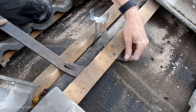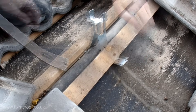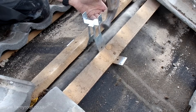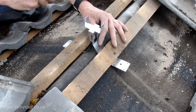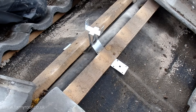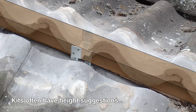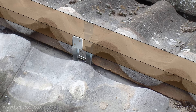Once you have it under the tile battens you can bend the brackets a little more ready for sliding onto the truss beneath. Use the flat pry bar if you need to. Once you get the legs onto the edges of the timber underneath it's very easy to slide it into position. Using the tension between the lath and the truss you can adjust the bracket for height either up or down very easily. If you use a good quality galvanised nail you shouldn't have any problems with penetration or bending. The finished installation height is usually so that when the ridge fixing batten is placed into the accompanying bracket it finishes flush or just above the highest point of the roof tile.